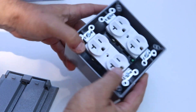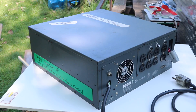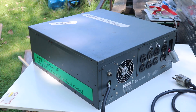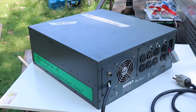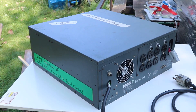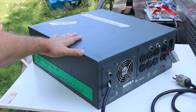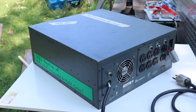I've got this set up with two 20 amp outlets and it's a metal box — nice and sturdy. Not shown here is a gasket that goes in there as well. The other big item needed for an off-grid solar project is an inverter, which takes the battery's direct current and converts it to alternating current wall power. Now this is not actually an inverter — it's a UPS, an uninterruptible power supply, but I'm just going to repurpose it and use just the inverter section. It was a rack mount designed for IT stuff, server rooms, that kind of thing.